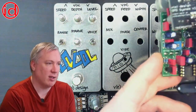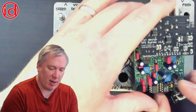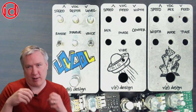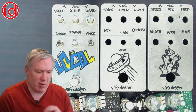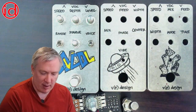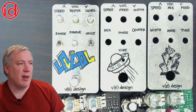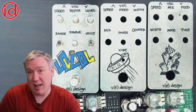Lastly, with the Coral Reef, there are actually two delay lines in here and I'm still experimenting with the voicing. There's also a trim pot to adjust the maximum feedback level so you can get to more extreme feedback sounds within the chorus/flanger-esque thing. There are two different delay chips with different delay times: an MN3007 and an MN3009. The mode switch actually switches between the chip with the faster delay time and the one with the longer delay time, and when you put it in the middle they're both in at the same time.